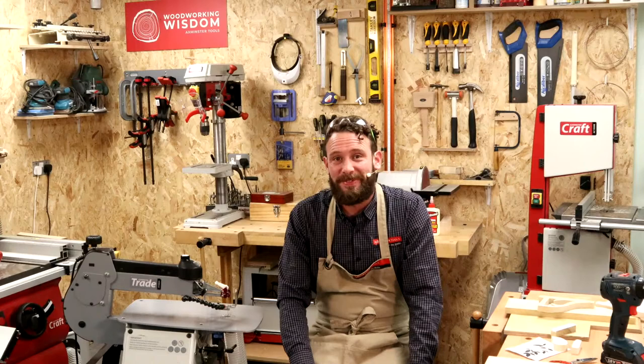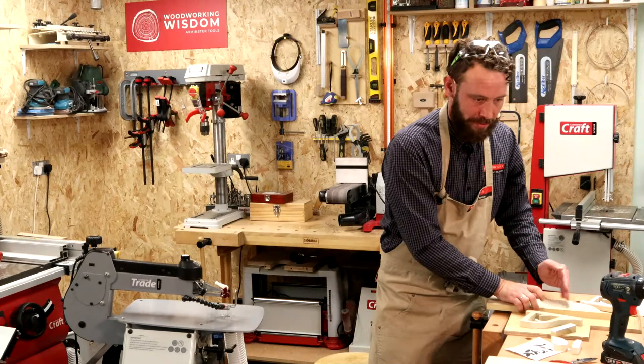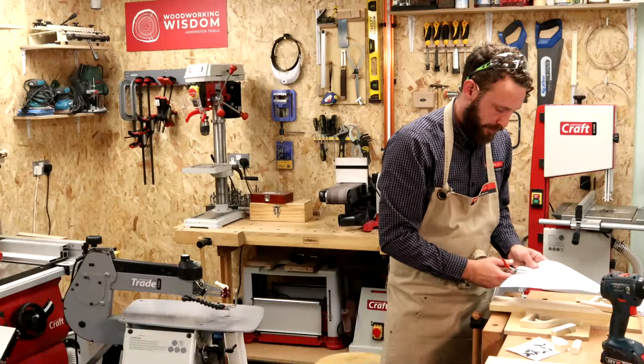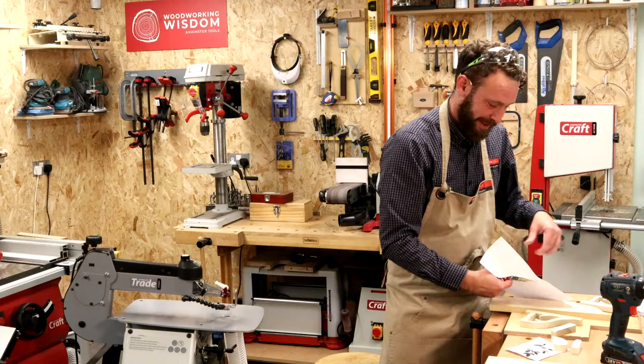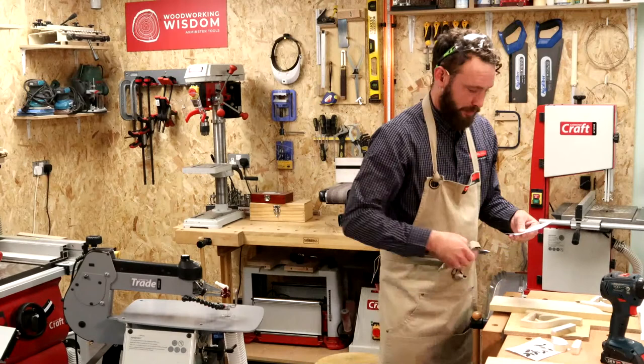Okay, another question. And the last one, well, actually, this is from Frederick, but it's a question for me, if you don't mind. Yeah, not at all. It's just been watching the finishes stream that we've done a few weeks back, and just wondered if force drying the finish with a hairdryer will make a difference to the outcome. Firstly, Frederick, it wasn't a hairdryer, it was a Craft dryer. Hairdryers are too powerful and they generate too much volume of air. And no, it doesn't make a difference because it's a gentle drying action. It's warm, not hot. So no, you'll be absolutely fine. All you're doing is evaporating the thinners that are in the finish. That's it. Good stuff. Thanks, Colin.